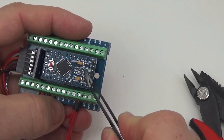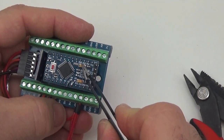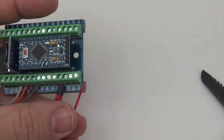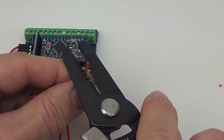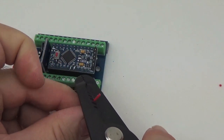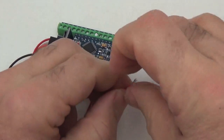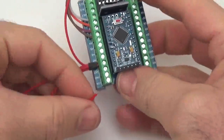This capacitor is now an orphan because we removed the regulator, and so we can bring that into play to help stabilize the system voltage just by making this jumper. So it serves 2 purposes really. Gives us a power point for the RTC later, and it brings that capacitor into play.